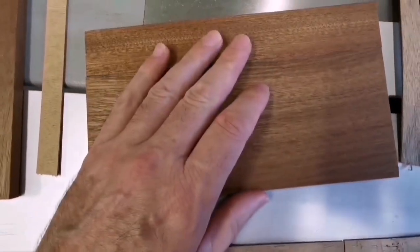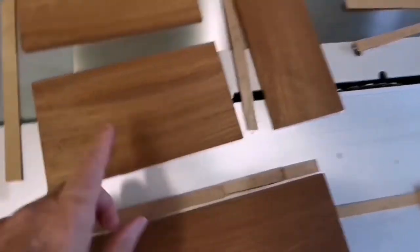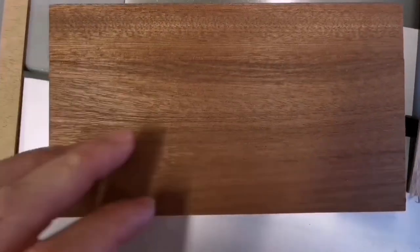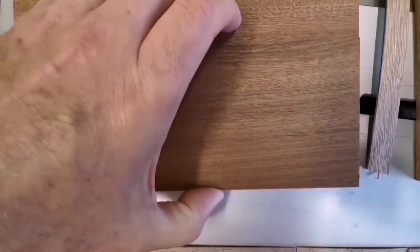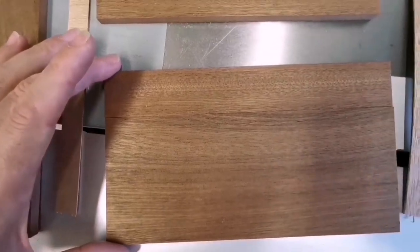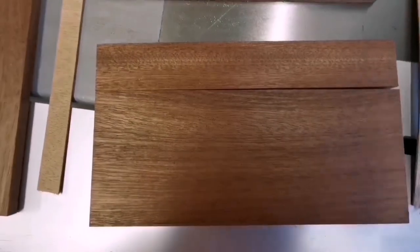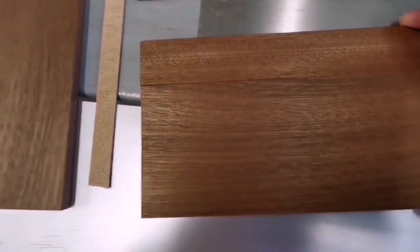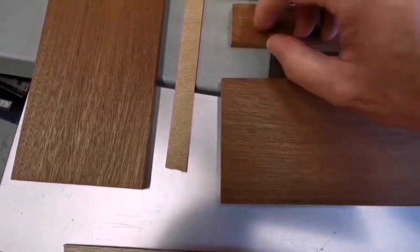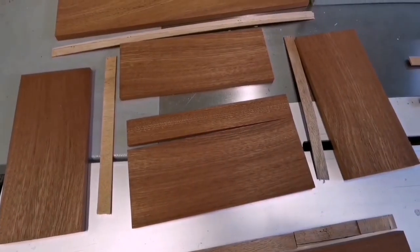And what we're going to start looking at is the joints between each piece. Bear in mind, they've only been through the saw, so nothing's been planed. But I just want to show you how I look at a piece of timber and how I work out the planing and whatever. And what this has got, something interesting about it. Watch this. See that? If I squeeze that in really tight, I think it's got a little bit of snipe on the end of one of these. So I'll plane those two edges first. And yeah, let's get on with it.